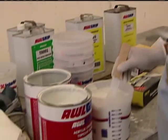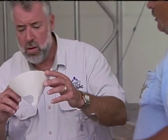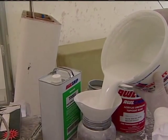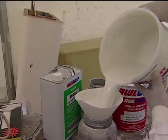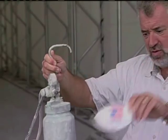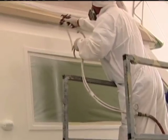When you're mixing up this paint into the paint bucket, do you have to filter it at all? That's where our strainers come in — this is a very fine mesh strainer, and we will run all our paint through that before we put it into the spray gun so we don't clog our spray heads. It goes into this canister here. These spray guns work with air pressure, and it is crucial that you do this in an environmentally responsible way — you want to make sure that you're in an approved spray booth, like the multiple approved spray booths they have here at American Custom Yachts.